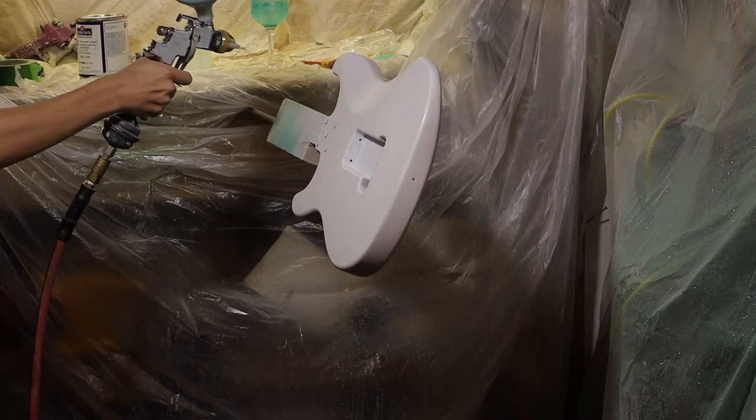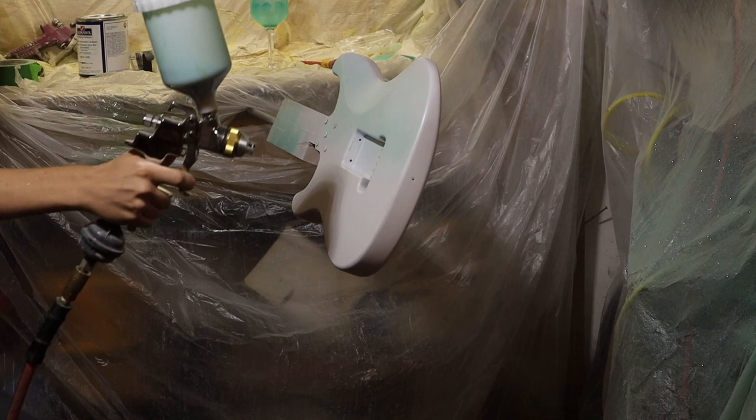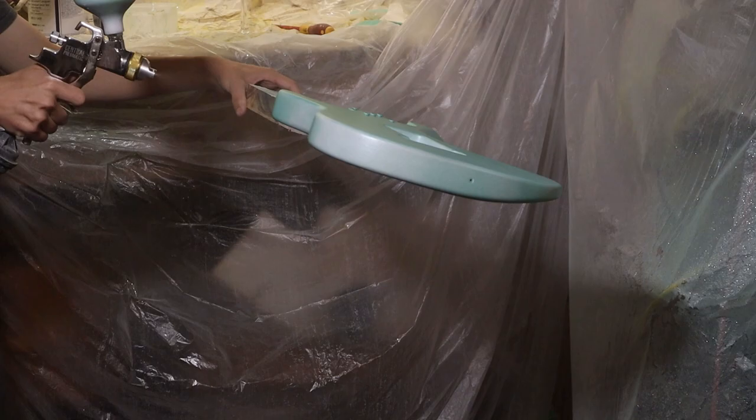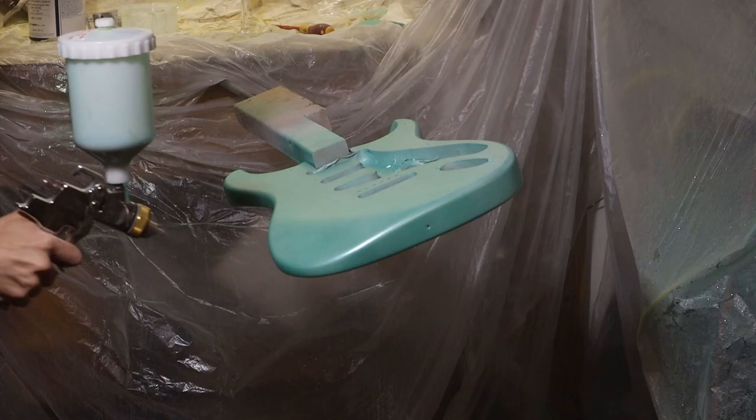So now it was time to start spraying the lacquer with our gun. It's a Harbor Freight HVLP spray gun that I'll link in the description as well. And it was actually a really great gun to use for this project. With this and the last coat, we were trying to make sure we had as thin of a coat as we could, because my goal was to get a really thin finish that would wear easily and get the relic look, but with true playing over time.